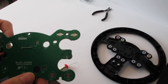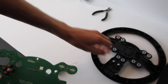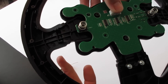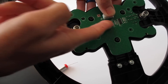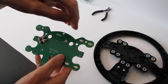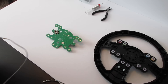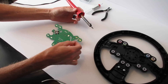Each side of the B button has little pads with fingers that connect both sides, and we're going to solder to both of those pads. Look at the steering wheel to find where you'll have room to run the wire — on this wheel the best place is to run the wire straight down through the bottom. We're going to wire straight to the board, one wire on each side, being careful not to solder onto the little fingers.